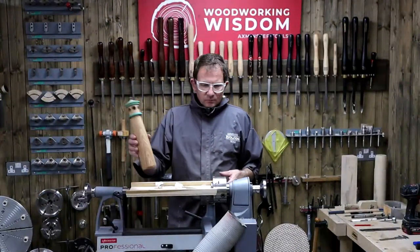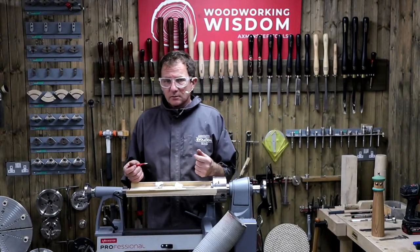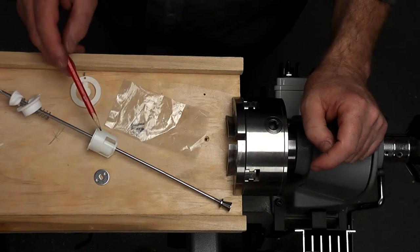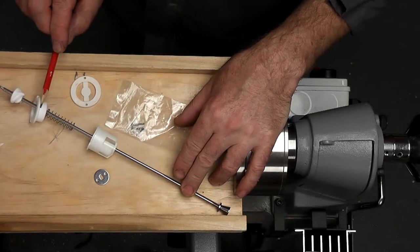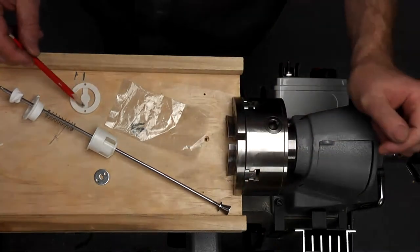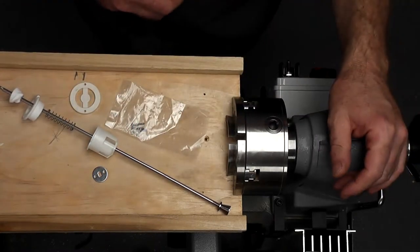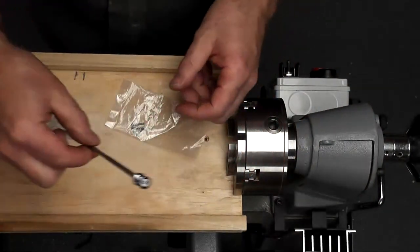We've got our lighthouse shape. We're going to use a quite standard mill kit — quite easy to get holders. These have a stainless steel bar, a plastic insert cap which is the feeder that allows the salt to drop through, a spring loader, a ceramic grinder and mechanism part on the bottom, a plastic cover to go underneath, and a washer plate on the top with two holes and a square cut-out that allows you to turn and operate it. It's a quite basic kit, nothing too expensive.